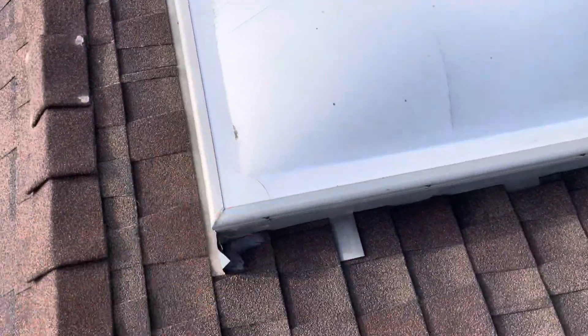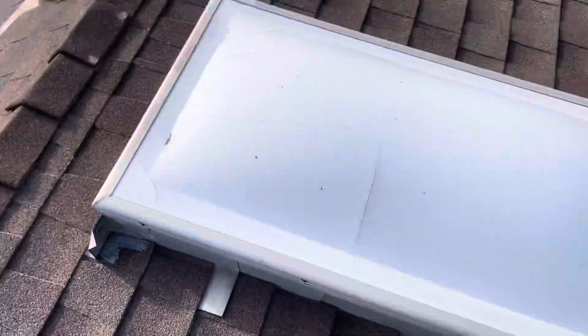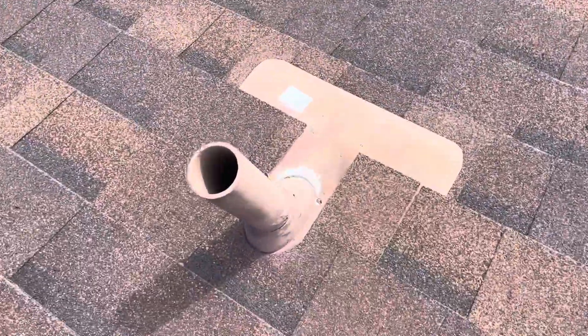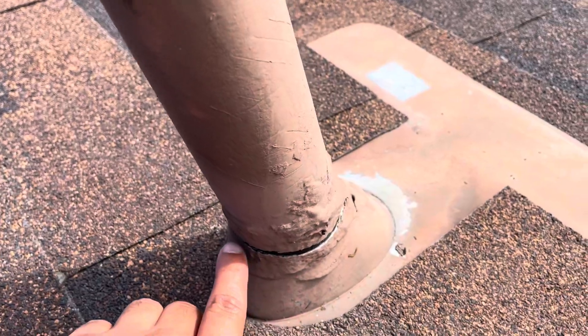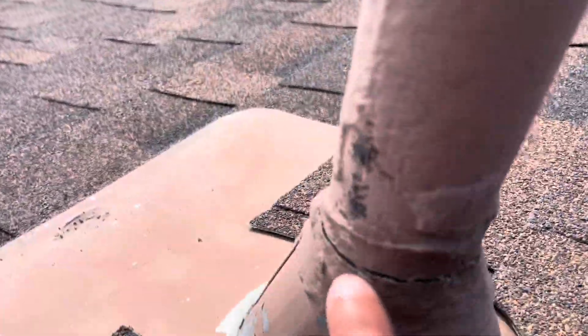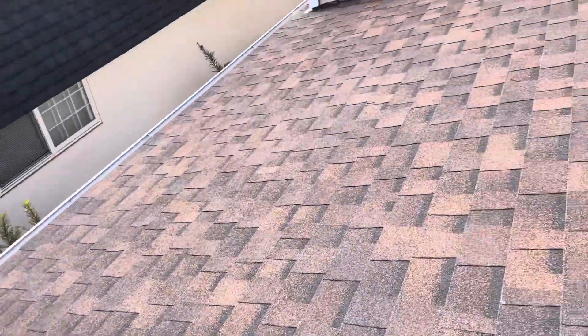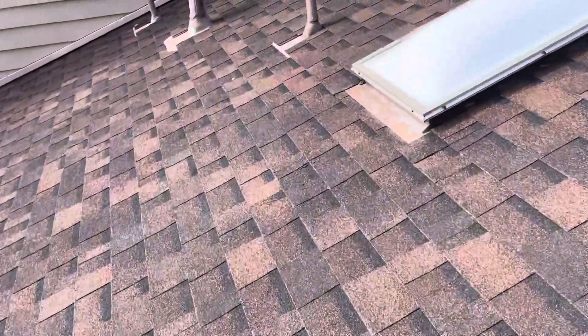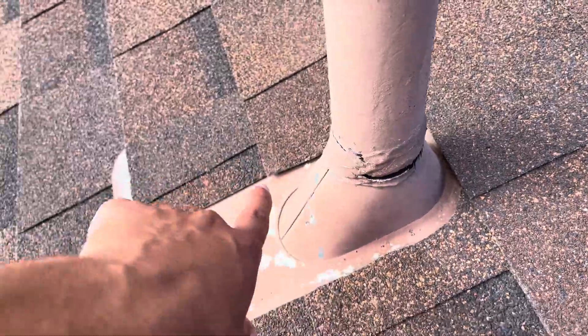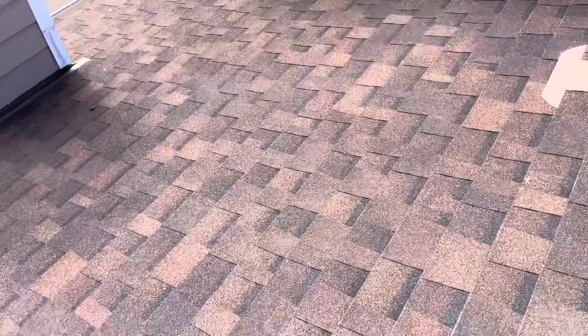We have two up there and another leaky skylight over here — this is my guess as to where that third leak is coming from. This is all cracked, so this is definitely going to need to be replaced or sealed up because that is a leak. And then around these penetrations, these seals are open. Same thing over here — these penetrations need to be resealed. This one is completely open as well, so anytime it rains, that water is going to go straight down into there.